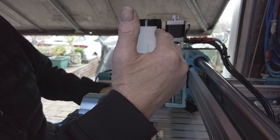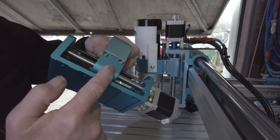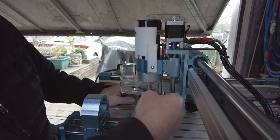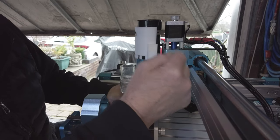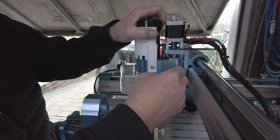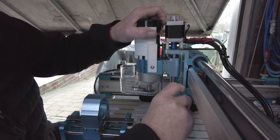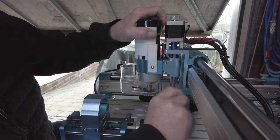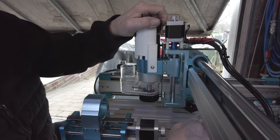What the gentlemen are proposing to do is put that old part onto the upgraded frame, which will give them more travel. And if that fits on there, you will get more travel. But what you've got to remember is that the upgraded design was done to give you stiffness — it is a lot more rigid because that collar is wider, giving you more surface area over that rod, so it's harder to bend and flex. That's what gives it its rigidity.